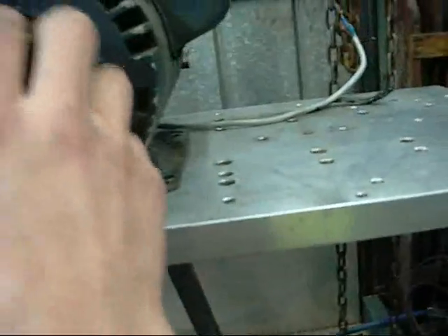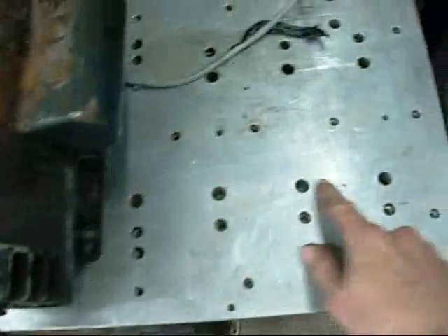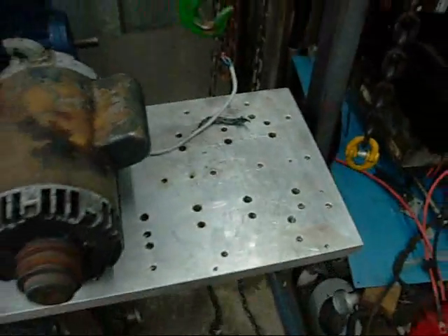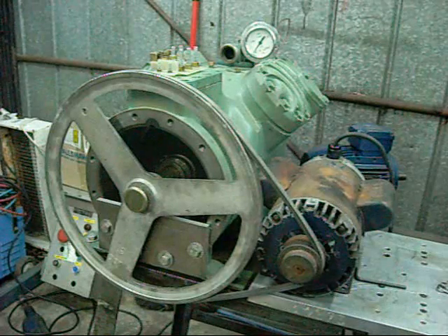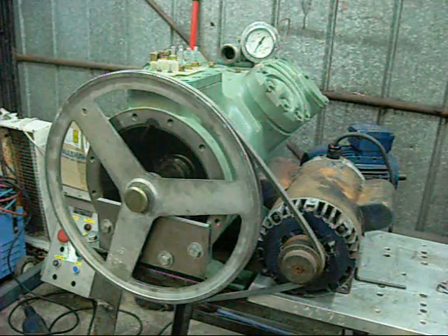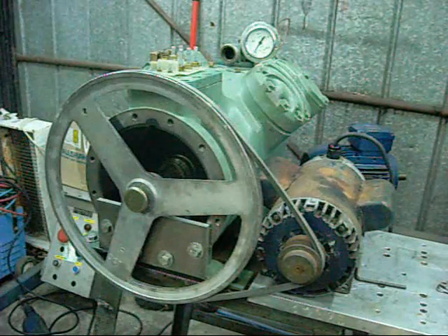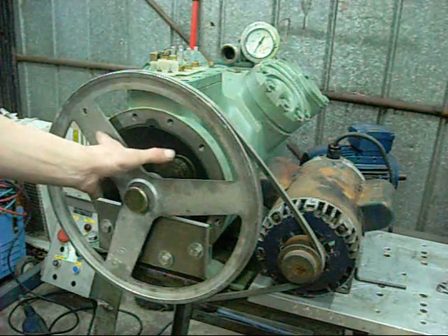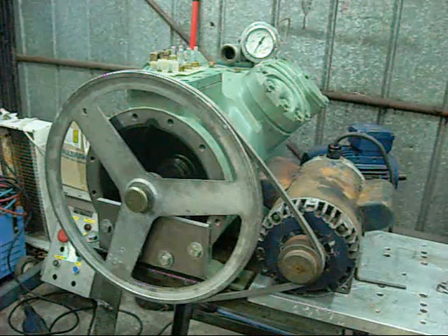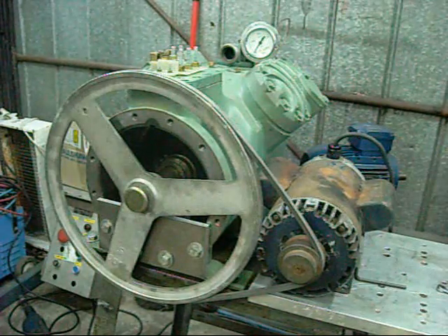The base is damaged but it'll be alright. I've got this big piece of 1-inch aluminium plate to bolt to the table, and I'll just find some suitable holes to bolt the motor through. It's full of different holes and things — it used to be a backing plate for an autocor box. Alright, let's give this thing a run. It's going to be very slow because of the pulley reduction. I'll work on remachining some new pulleys — maybe reduce that one a bit, increase the motor pulley, use some B series belts, just a pair of belts. Try this for now.